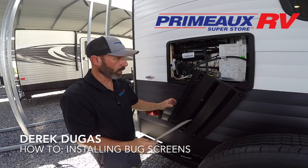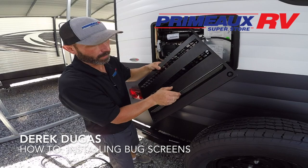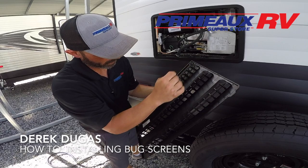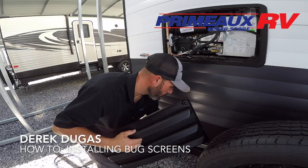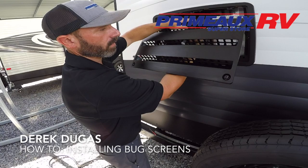Here are the ones you're going to need for your breather on your icebox. You're going to take off your breather and pull out your drain hose. The screen is going to fit on the outside at the bottom. You're going to have some little white tie wraps that go with it. All you're going to do is tie wrap it on all three. But the one that your drain plug goes through, you're going to have to mark that square and cut out a little square on your screen so you can fit the drain plug back through.